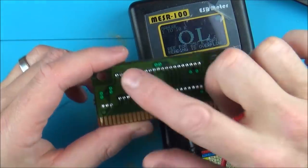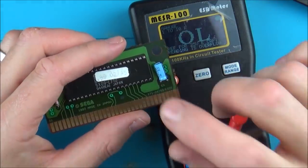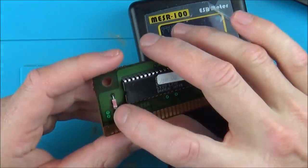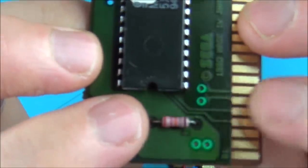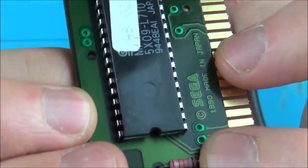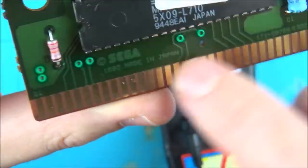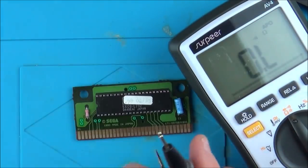I'm just going to get my multimeter and check for continuity between here and all the pins. I'll unsolder the capacitor just to check it — to see if it's actually testing at 47 microfarad. This other component is confusing me at the moment. I might try to get a reading of it online using the color code, because I can actually make out the bands clearly. But first let me make sure it's not a problem with the circuit board itself — I'm putting my meter to continuity.